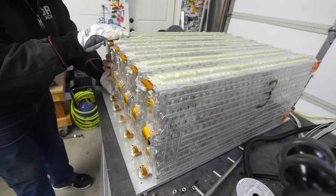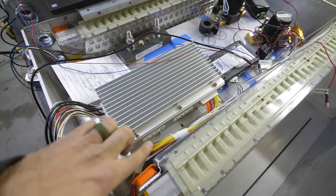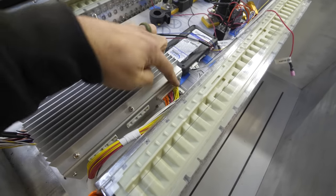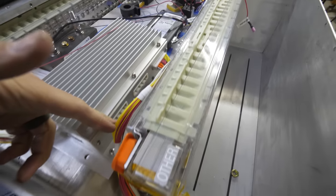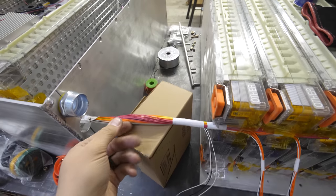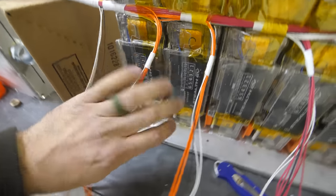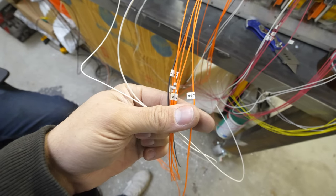Cell tap number one is going to be the box behind the passenger. We're starting on the opposite end with the highest cell tap, which is our positive-most battery. This is just about the BMS cell tap wiring. We have the thermistors and cell taps coming out here with about 2 inches of slack, and then the cell tap and thermistor wiring matches the pinouts on this board. Each one of these little wires is very specifically labeled because they need to be put into these plugs, plugged into the boards — that's how the BMS knows which cell is which.